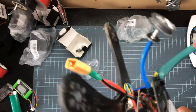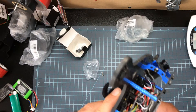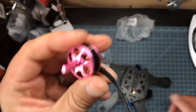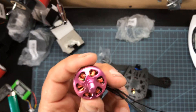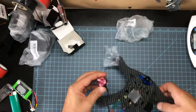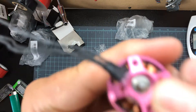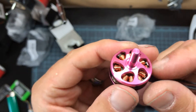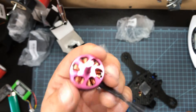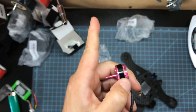I'm going to slap them on one of my hellbenders — this is the version two hellbender with an Omnibus F3 and a 20-amp ESC, so not super special. Looks like everything will reach. These wires are funky so I'm going to put some wire wrap on them, which ought to be easy to get through. Interesting motors — I like the build, they feel really good. I like that they use a Q-clip instead of a standard C-clip, and I think the cooling is going to be nice.